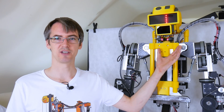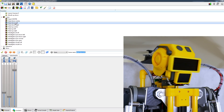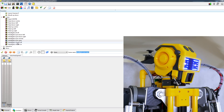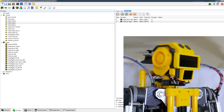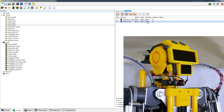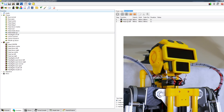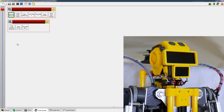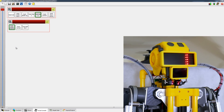Because the robots are just DMX lights, we can use QLC to make animations for them — like this Larson scanner effect. We've got various scenes which are now robot head positions that move the head to different positions, with faders in different positions for lighting effects on different channels. We've also got chasers — so playing the head diagonal chaser moves the head between two diagonal positions. The virtual console buttons can be assigned to external interfaces.